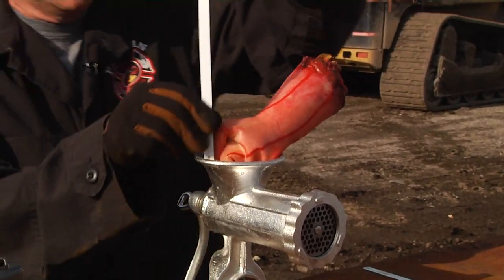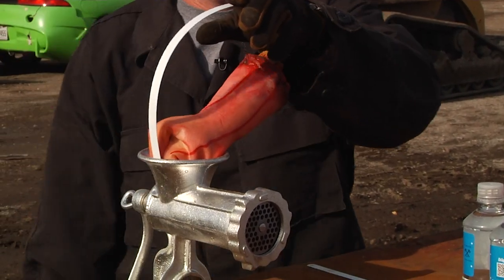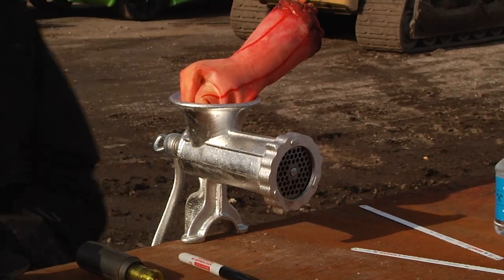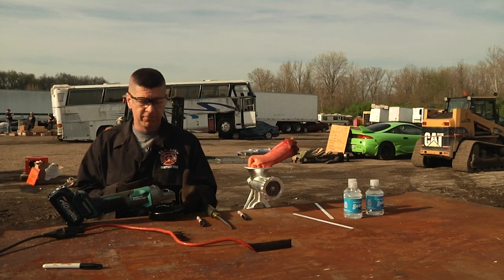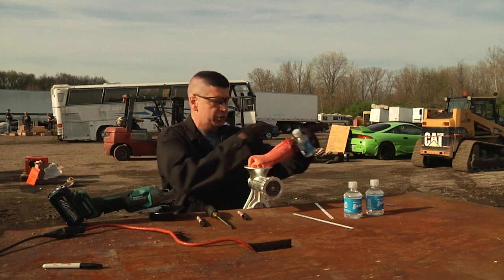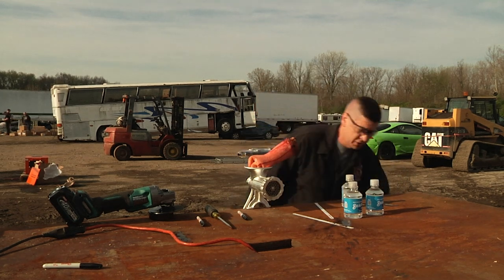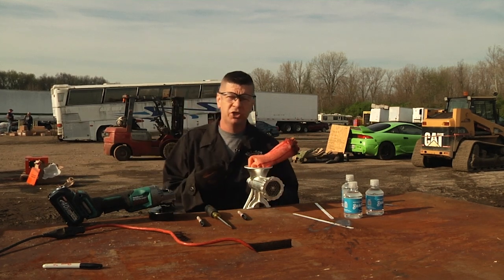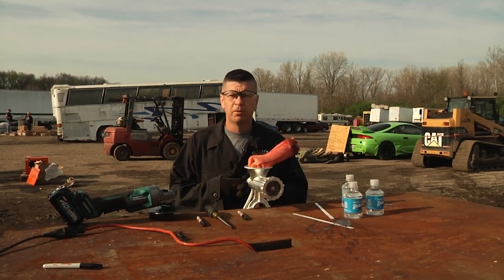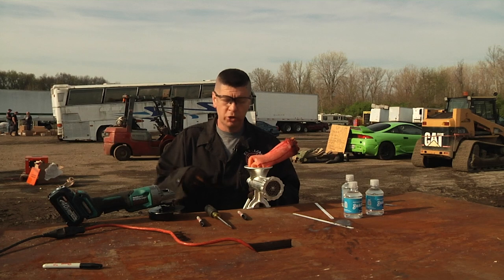The advantage of the flexible shim is I can bend it out of the way. It's going to be very busy in there, so this allows me to move it aside. If the grinder kicks up for safety, I'm out of the way. Same thing when I front-load it — if the machine kicks out to the front, I'm not in a danger zone. The other way we can injure this individual is through friction heat — the blade cuts by friction and that creates heat. So we'll use water bottles with a small hole poked in them, or what we prefer, a garden sprayer, which gives us an endless supply of water. At a butcher shop, there's normally a garden hose nearby that they use to clean the machine for health codes — take the nozzle off, just crack it open. We don't need 180 gallons a minute; we just need to absorb the heat we're creating.